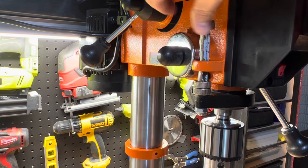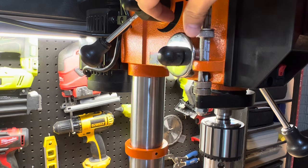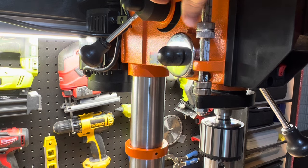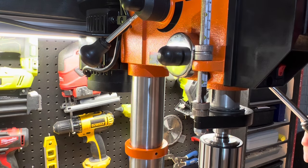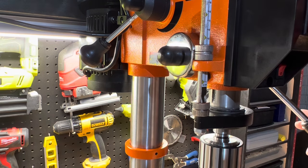It has a drilling depth gauge that can easily be adjusted. Simply rotate the lower depth knob until the bottom is aligned with the desired depth mark — one inch in this example — then rotate the top depth knob until it meets the lower knob. I use this feature quite a bit to make repeatable holes at the same depth on my projects. The depth gauge is also useful for removing the arbor and chuck, making it easily accessible once locked all the way down.